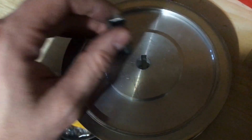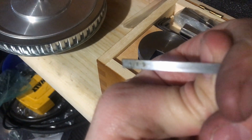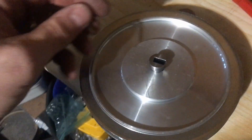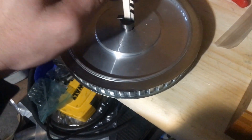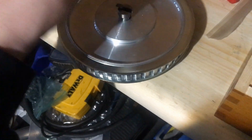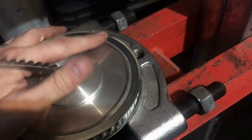We're going to select our proper die size - we've got a half inch hole and I'm going to cut another keyway in this just so you guys can see. Take the half inch, it fits in there. Find the appropriate shim - on this particular kit they're labeled. It says 1/8 B shim goes in here, and then we select our proper cutting tool. Basically all you're going to do is push it down in there and cut a keyway - it's pretty slick.